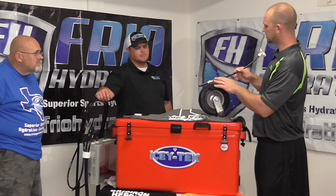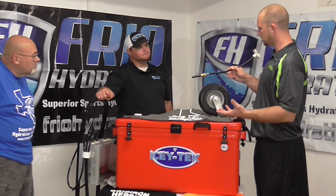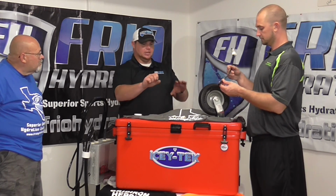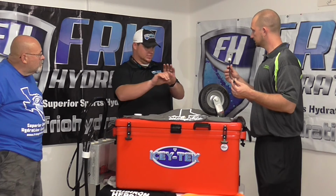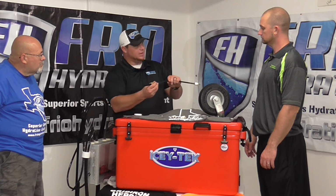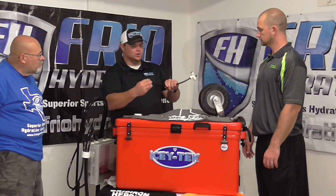But any other tips on any other, like I know you talked about heat shrink at some time, any other way to cover this up to protect the? You can do heat shrink. The heat shrink that's going to need to be big enough for that is more uncommon. You'll have to find it on Amazon. It is possible to find it, and it's just a piece of vinyl tubing that would slide over there, apply heat to it via a heat gun or a little torch, and it'll shrink up. It'll give you that sealed package that you kind of want to protect. However, these are PEX clamps. They give us pretty round edges. We don't have any problem with anybody hurting themselves.